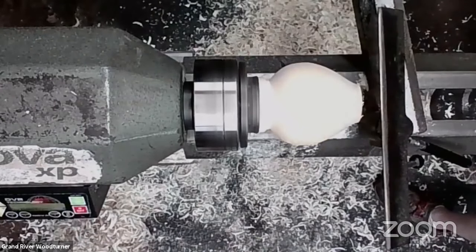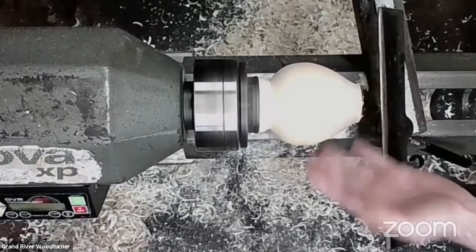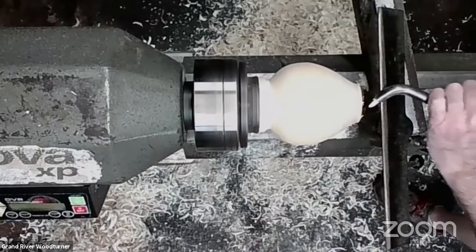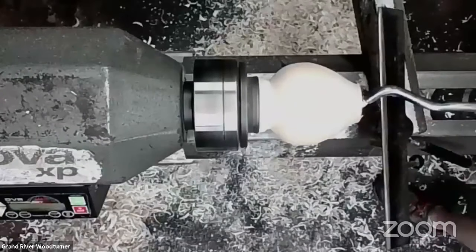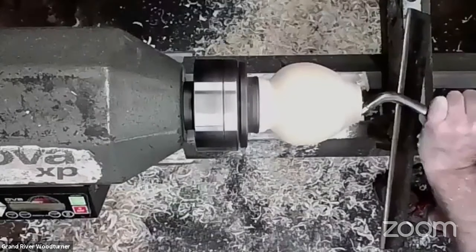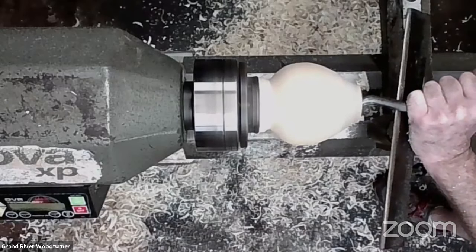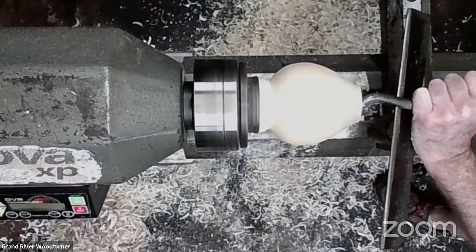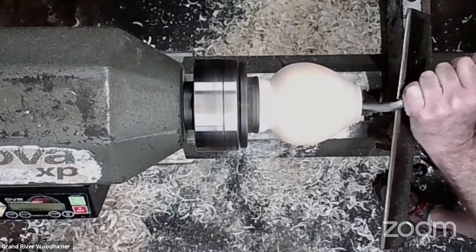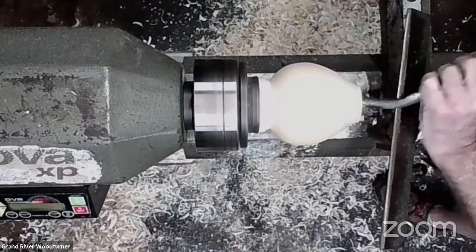And I guess if you turn enough wood, lighter colored woods anyways, like apple, pear, maple, anything that's got that lighter color, the light's going to shine through it. With different woods, you'll be able to tell the thickness by the amount of light shining through, and what color it is, just by doing that many different kinds of wood. Maple, you can get pretty thin. The light shining through the edges will become almost a bright yellow color.